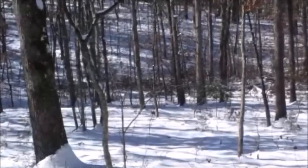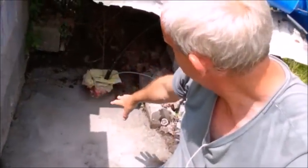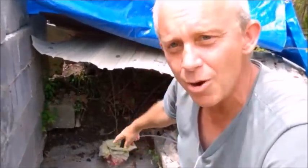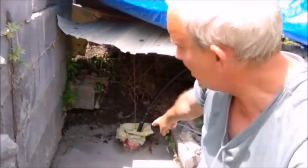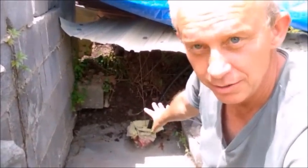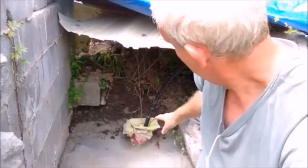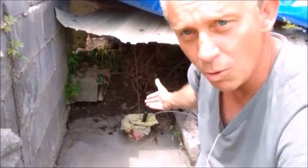Hit the bell notification. So a couple days ago, I showed you that I concreted the well floor here. I reconcreted, I should say. It had a layer of concrete, but it was so old and busted up that it was no longer serving its purpose. Its purpose is to keep water from going down around what's called a well casing. So where you see the coffee can right now, that's temporary. I'm going to replace that with about a 3-foot PVC pipe. But in the meantime, I'm using that so water does not run into the hole of my well.